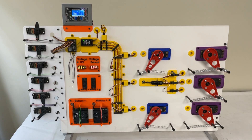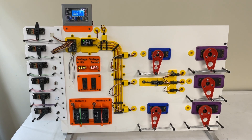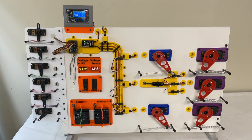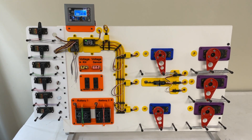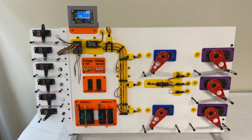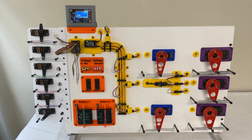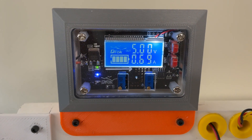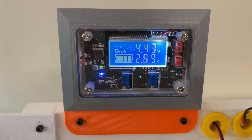Now looking at the S-Bus system, you can see on the left digital display that is the receiver battery level — it's not changing. But then look at the servo battery level: you can see it going up and down as the torque on the servos is applied. You can go back and watch one of my other videos on this subject to understand how to run two batteries for your system. Here is the amp reading on the higher-torque system, and you can see it gets up to about 3.5 amps.